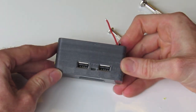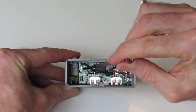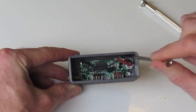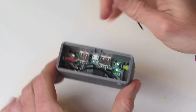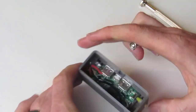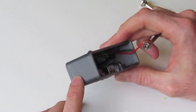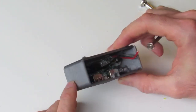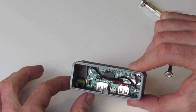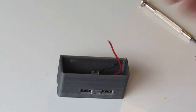So now you see that your USB ports are lining up correctly. Our clip is in the correct place, just overlapping the board. We've got our board sitting flush with the top of the standoffs, here and here. And they actually sit on top of the standoffs, you can't see, now the board's over top of them on the other side. That's nice and snug in there, it won't move. And just double check that your button, you should be able to hear it click nicely, pushing up against the button switch on the PCB assembly. So next, we need to install our battery holder.